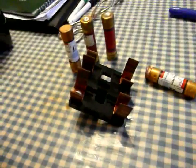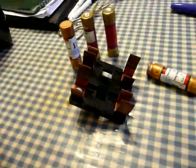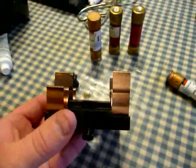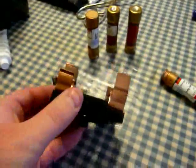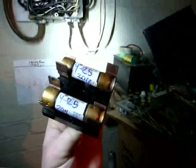Now, our home is serviced by older electrical equipment. But as long as you're mindful of its limitations, you don't overload it, and you take care of it, there's nothing that makes that dangerous per se. You can see the difference between the one contact that I've cleaned and the others which remain uncleaned so far. Go ahead and shine them up, then hit them with a little oxidation guard. As you can clearly see, I've gone ahead and dated these just to see how long my approximately twelve dollars worth of fuses are going to last. So go ahead and plug this back in — just like that.